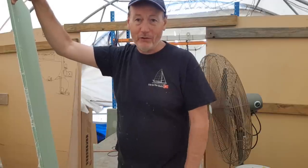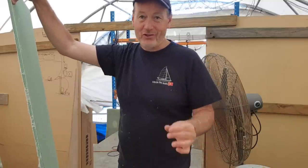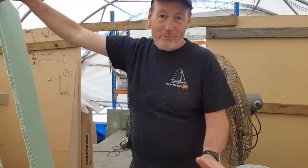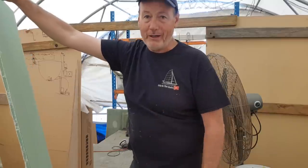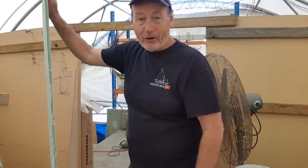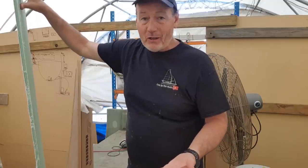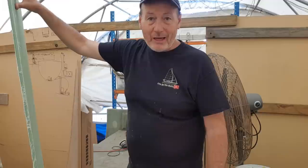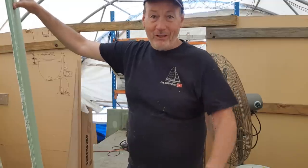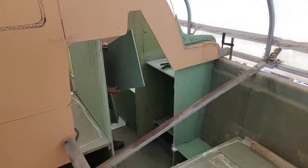And all of my lower bulkheads up underneath the floor, which is any area that's going to impact, is probably underneath or maybe along the hull side. So they're certainly a lot thicker than your average kit boat. Now, is that going to detract from performance of the boat? Absolutely. I'm adding weight, but I'm also removing weight in areas where I can, such as this here. That as a robe face is lighter than the fiberglass module that I've actually laid up there, and probably just as strong. And to be honest, it's only a robe face anyway. So at the end of the day, cut out the weight where you can, add it where you have to, to get the strength and the resilience of the boat. I want this thing to last for eternity, or at least my eternity anyway, and it will last at least that long.